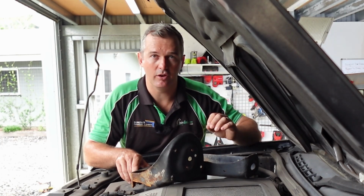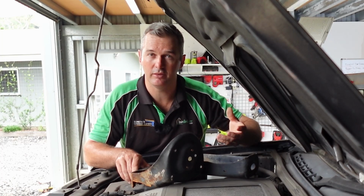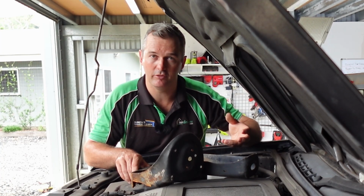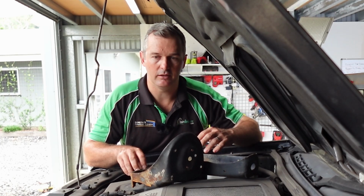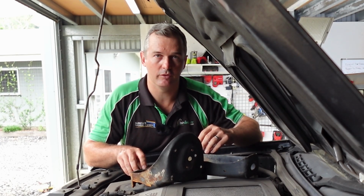The advantage with the hydraulic bump stops is you can really fine tune that full compression point, whereas with a rubber bump stop, it's hard to know exactly where final bump is, because the harder you hit, the more that rubber will compress. So I will still keep the rubbers in. I think that's what the engineer will want. He wants rubber bump stops still, but the hydraulic bump stop will make the final stopping point at full compression.